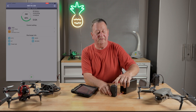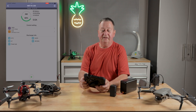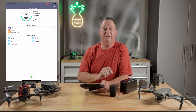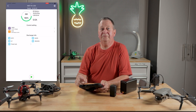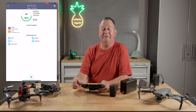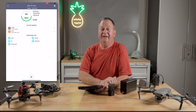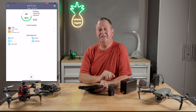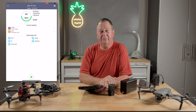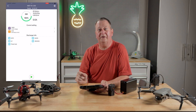Turn the battery on and touch one of the buttons on the front of the discharge unit. This battery, as I found through experimentation, will only accept a maximum of two amps of discharge. I originally set it to five amps like everything else with a 4S battery, and it kept turning off. I was disappointed thinking my connector purchase was wasted. So I started decreasing the amperage — half an amp worked fine, and I worked up to two amps. At about two and a half amps it automatically shuts off, so two amps is the maximum.